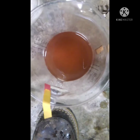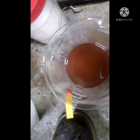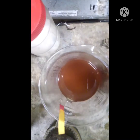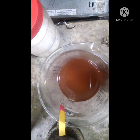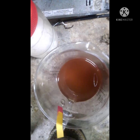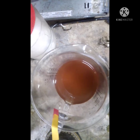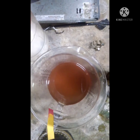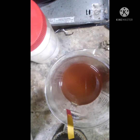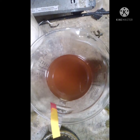I did a pH test and my pH is at about one or two. Now I'm going to add saturated sodium hydroxide solution, shooting for a pH of 11 — maybe 11.5. It's crucial not to go way past 12, so don't go crazy changing the pH with this.